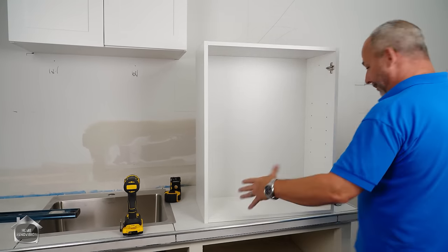Okay. There we go. Just a little something to make sure that the screw is going into the middle of the hole, which is really the goal here. Somewhere for the screw to start. This is why pre-drilling is so important. You'd have to have 13 fingers to do this. All right, again, don't over tighten the screw. You're just gonna core out the building material. Once it's snug, you're done.